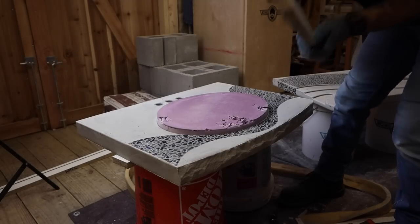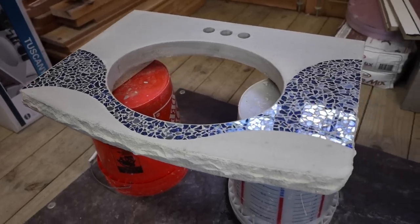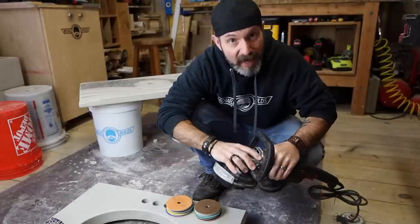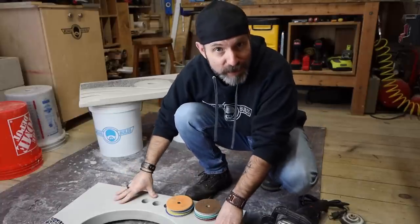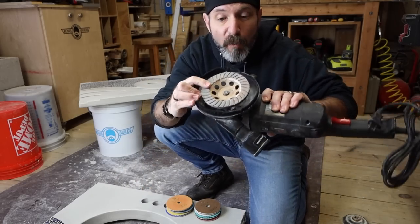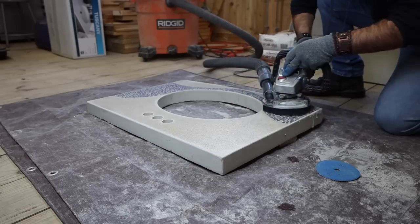And then there's the reveal. Now it's time to polish these bad boys. I'm not going to spend a lot of time on the polishing details — I'll link that video in the corner. But the key thing is that both get polished, however this one will have exposed aggregate and this one will not. To get down to the exposed aggregate, I'll first use a rough diamond wheel to get past the cream and down to the rocks. On the other one we'll skip that step.